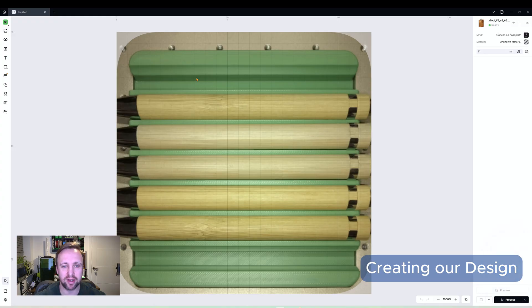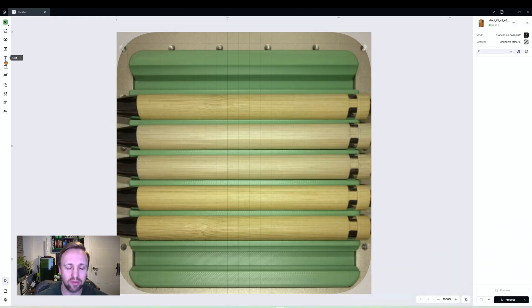Now let's look at putting our design onto the pens. When engraving onto cylindrical objects there is a narrow flat area on top where the laser engraves cleanly, but if you try to hit the curved sides the laser refracts or bounces off and just doesn't look great. We want our design to fit within that narrow window on top of the cylinder — approximately five to six millimeters height of text seems to be the right area to work with.